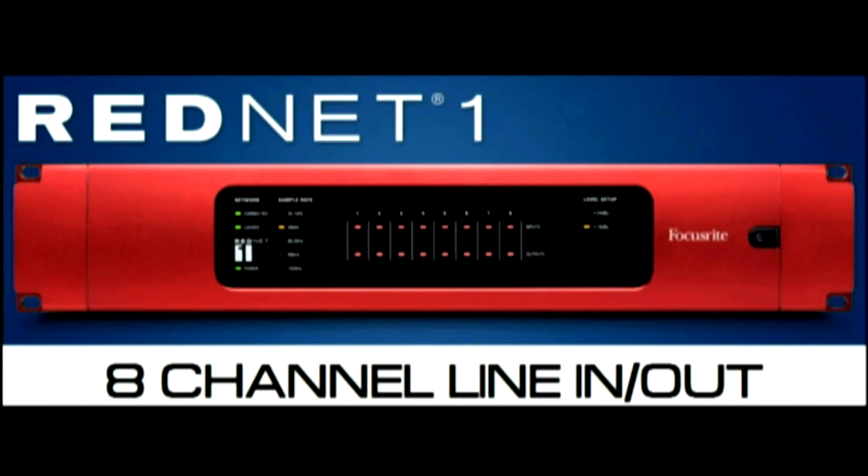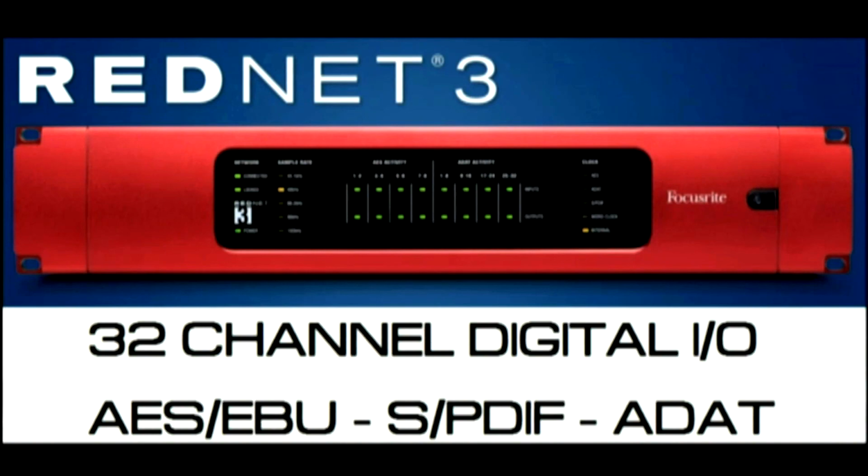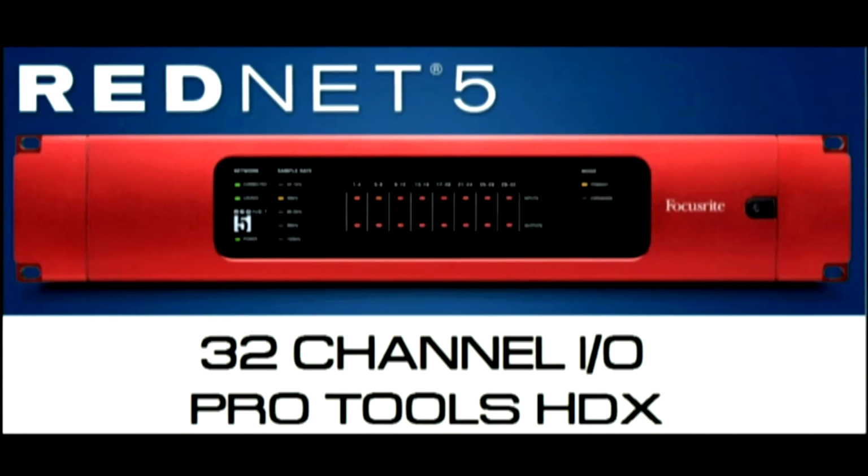Starting with the RedNet 1 is an 8-channel line-in, line-out interface that interfaces with Dante. The RedNet 2, which is what I'm running here, is 16 channels of line input and 16 channels of line output. The RedNet 3 is 32-channel digital I/O, and that's AES/EBU, SPDIF, or ADAT. The RedNet 4 is an 8-channel microphone preamplifier. The RedNet 5 is 32 channels of I/O to Pro Tools HDX. So it's a direct connection to Pro Tools HDX systems. So if you need to get out of Pro Tools, you can do it that way.